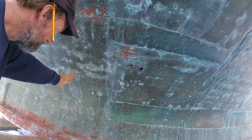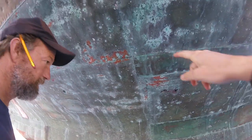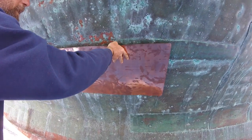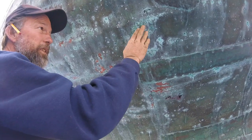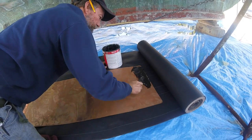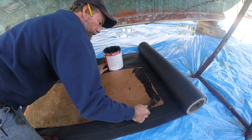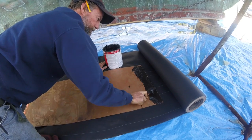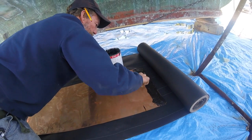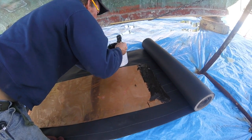All that and all this — I just figured it out. There's some up here too. Put that one on. That's not too bad. I think we can fill those, or even put a little piece there. So because you've got copper that you're going to put this over, you don't put tar paper. You only put tar paper down if it's wood. So you do tar, then tar paper, then tar again, and then you hammer on the copper. Being this is just a patch, I'm just doing tar and copper on it.